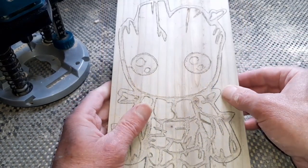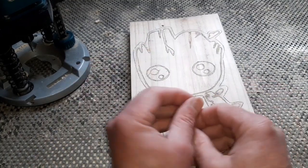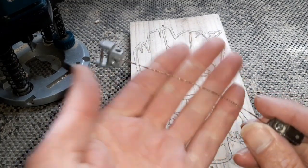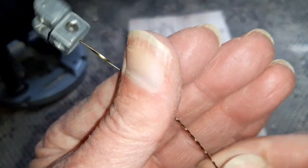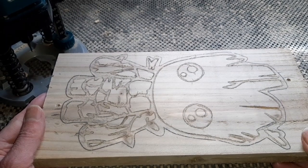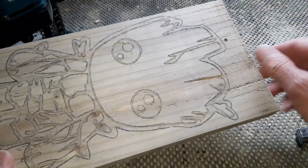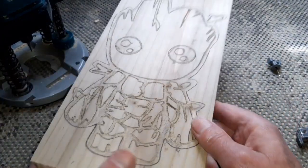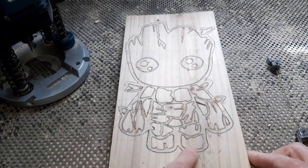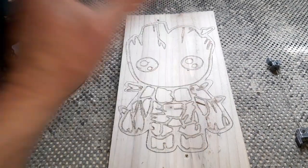Once we've cleared everything out, we can just go back and remove the top and bottom sections. Plus, because we've already cut around with the scroll saw, when we come to clear that area we can just route straight over the edge. The blade I like to use is a spiral blade — a great little blade. The teeth run around in a complete spiral the full length. The good thing is you don't need too much turning of the wood. You'll notice I've drilled two little pilot holes. I want to keep it in one framework in one piece, so let's pop it on the scroll saw and cut the shape out leaving the top and bottom as is.